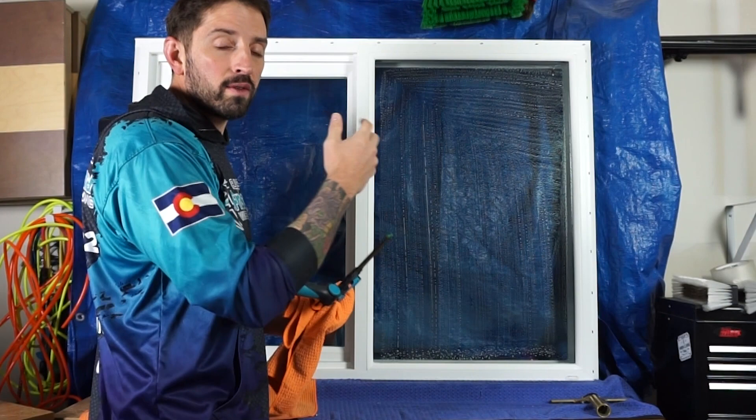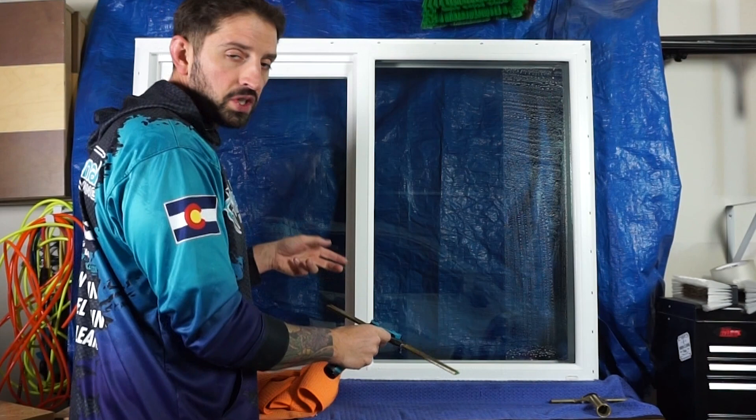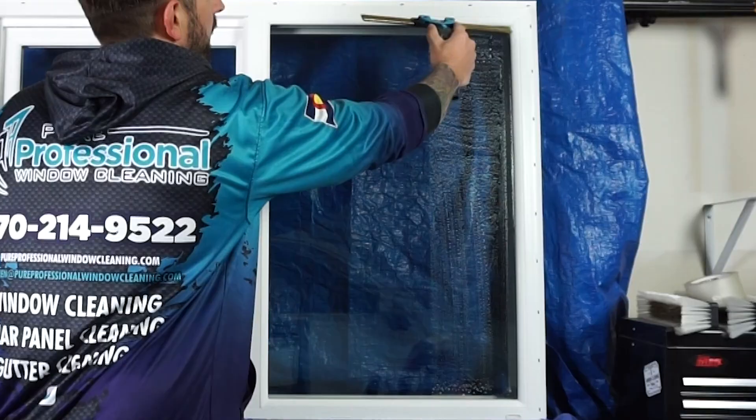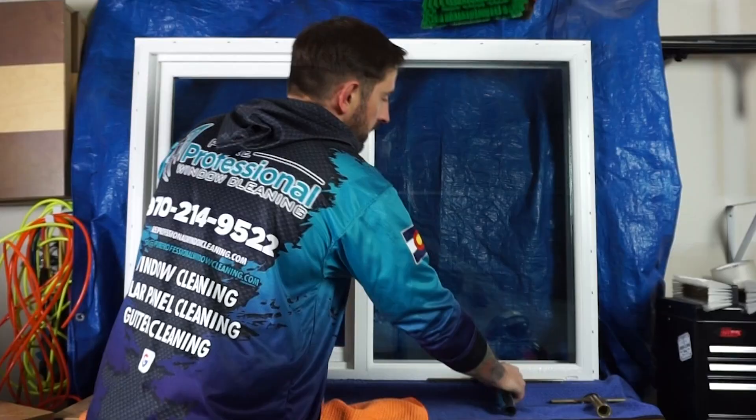So first pull — I've wiped my squeegee, I pull it down. There's very minimum water left here. Still a little bit for detailing, but it looks really good. I don't see any lines. All I like to do is just dry off the tip of the rubber right there. I like to keep the rest of the blade lubricated with solution. Then I feather a little bit and pull down again. And that is it.